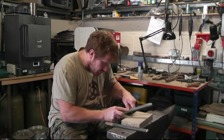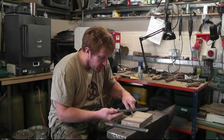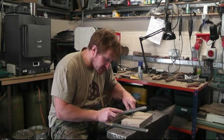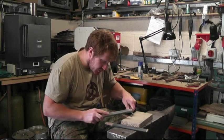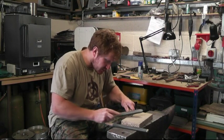It's important now that we don't push the leather into the cutting edge. It will cut your strop up, but because of that grit being in the leather, you'll actually dull your tool. So ensure that you're pulling straight off the bevel and lifting it back up and placing it there for the next stroke.